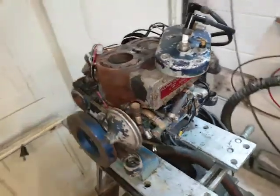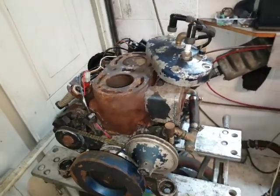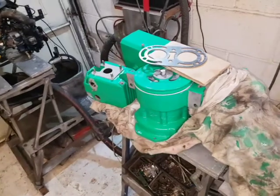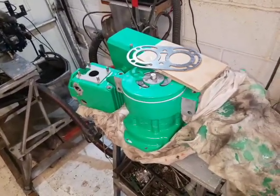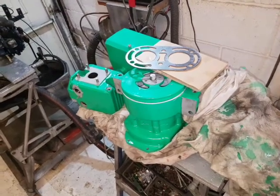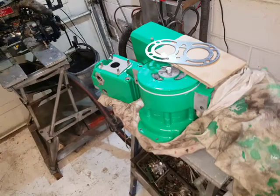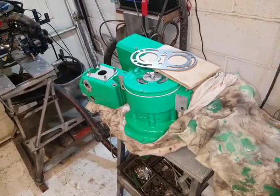So I won't tell you what to do, but my opinion, I wouldn't buy a Dolphin engine without expecting to do major work on the cylinder head every couple of years, even if it was running nicely. But if it had a Vire in it, I would ask them, has it had the pump shaft and impeller upgraded? And has it got stainless steel main bearings? Possibly. If it's got all that lot, and all of my concourse engines has, that's a really good engine. It's going to last another 40, 50 years.